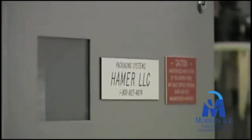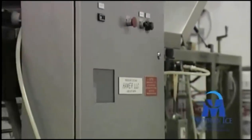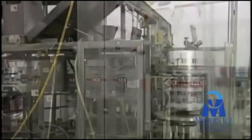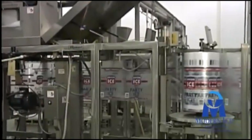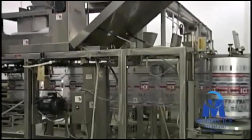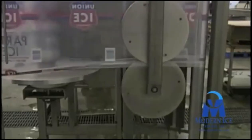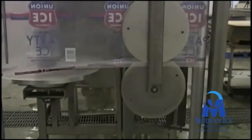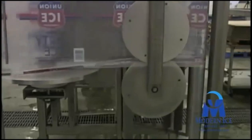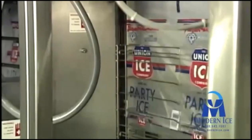In this facility, Hamer models 535, 1550, and 540 packaging machines are used. This equipment utilizes pre-printed bag roll stock, which is converted into a bag by the machine. As you can see, the bag gusset is actually formed by a special mechanism mounted just after the roll stock mount.